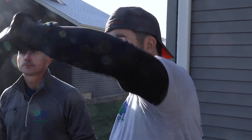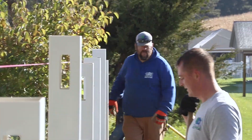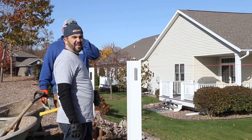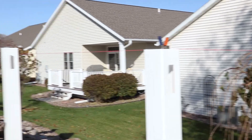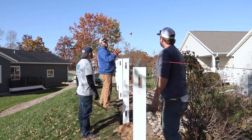How do you deal with it being kind of a roller coaster? Good question — you definitely don't want to follow the grade 100% or your fence is going to end up looking pretty terrible. It depends on what the homeowner wants for spaces underneath — a lot of times there's pets, and you can't have big gaps for the pets, so we'll try to find a happy medium where we can stay close enough to the ground without following it 100%. So you use almost like a chalk line to get the gradient of how the fence is going to lay out, then you change the height of each post and beat it down with a hammer or lift it up, going up or down on each post within a certain tolerance to make sure everything looks good.